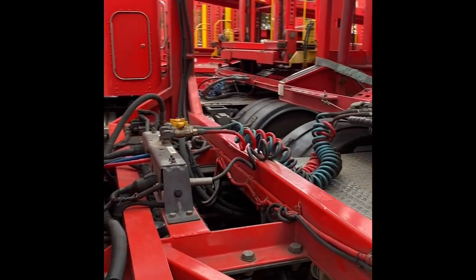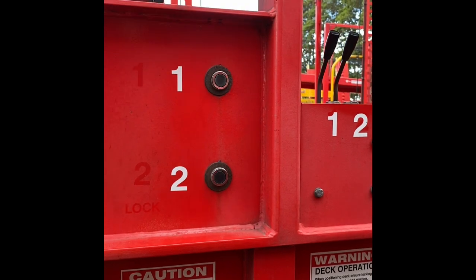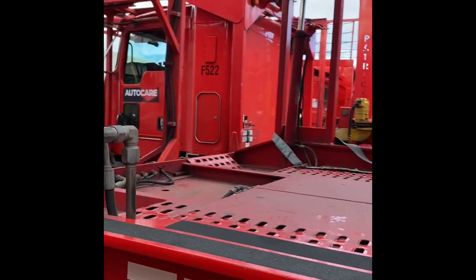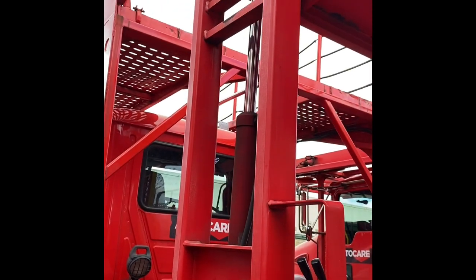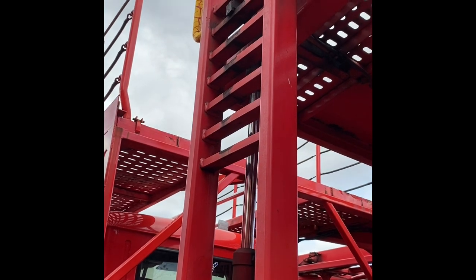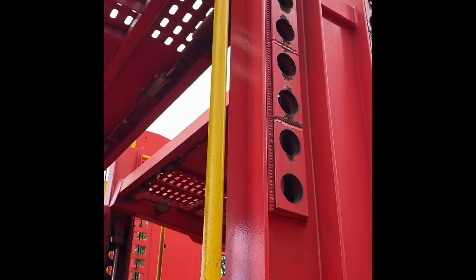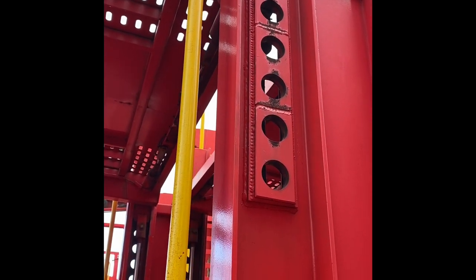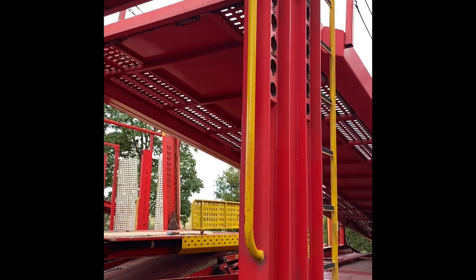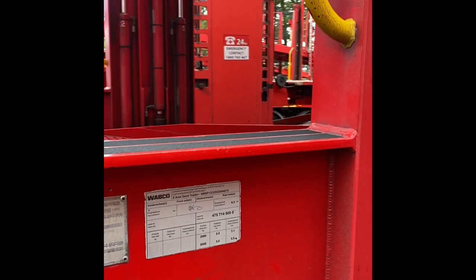From here we can see your typical airline Susie coils and hydraulic lines through to the trailer. This is the main control at the front for the top deck and also the pin deck at the front, labeled one and two, where the actual rams move the deck up and down. It's a bit different to say an H4 trailer where you get full movement — on this Pacific trailer you only get that amount of movement out of the top deck at the front and also at the back. There's not a lot of flexibility, but enough to make the Pacific trailer a really easy operation. It also has plenty of handholds and footholds for three points of contact when climbing in and out of vehicles and down from the trailer to restrain the vehicles.